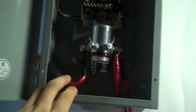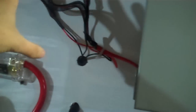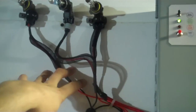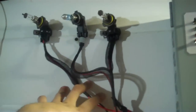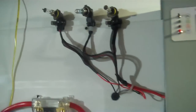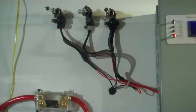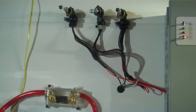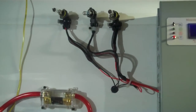Basically it goes into that disconnect right there. When it gets to a certain desired voltage that we set, it will dump off any extra power here. Right here you could actually put water heater elements, or quite frankly a lot of different things — even big resistors that will actually heat your home. And if you're at a 24-volt system, you could actually dump it back into your grid ties to pump the juice right back into your house.